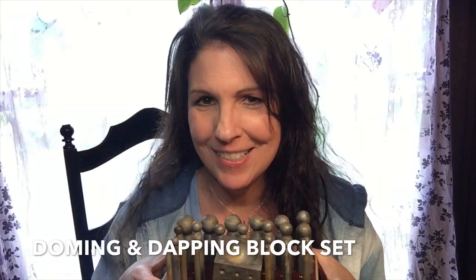I have another really cool project coming up after the tin video. If you have a set of these tools, get them ready because we're going to do something fun with soldering. Mine were rusted from sitting in a damp basement, so to remove rust from a tool you soak it in vinegar — that took all the rust off but also removed the shiny chrome, which is the trade-off.